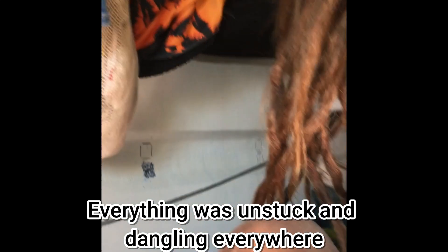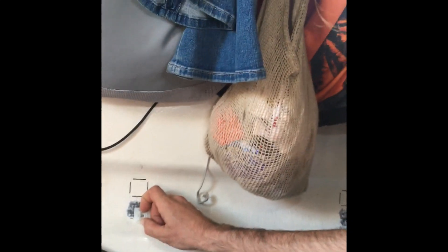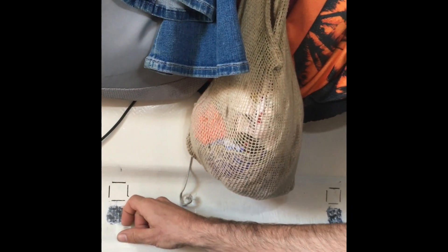Securing our wire ends — we should have seen this mess, but we're not gonna talk about it, we're just gonna move forward. Wires are a mess in this boat, just the way they were attached. We got our little zip tie anchors and we're going to glue them down. The adhesive they come with doesn't really stick and bond well. So we're going to try out some West System G-Flex thickened epoxy, which is epoxy designed for bonding plastics. It's really hard to get epoxy to bond to plastics, so you gotta do a lot of prep work: sand everything down, flame-treat it where you run a blowtorch off the surface, and proper acetone degreasing of the surfaces.